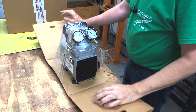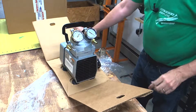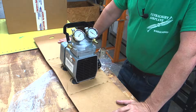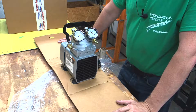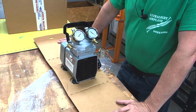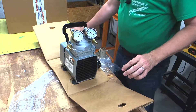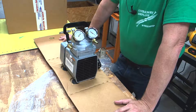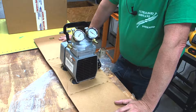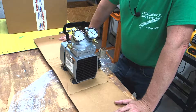This is the vacuum pump that I've ordered to help me with vacuum bagging and vacuum infusion. This is a diaphragm pump instead of a piston pump. For vacuum pumps that are going to run for many hours — which is what we will have, because sometimes these epoxies can take overnight to cure — it's preferable to not have a piston pump. Apparently piston pumps, when they run for many hours, will start spitting out an oil mist. You don't want any oil mist getting on your composites, because that will cause separation problems if it gets in between layers while you're laying it up. So that's why I got this diaphragm pump.